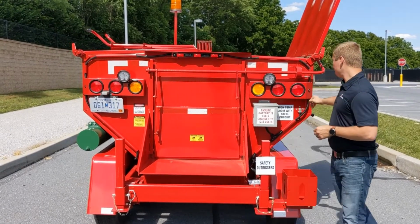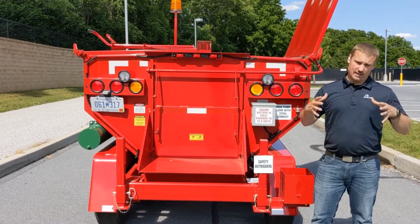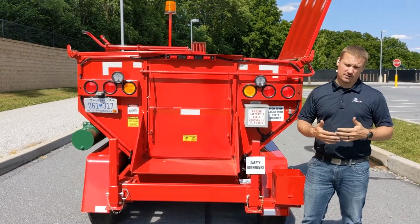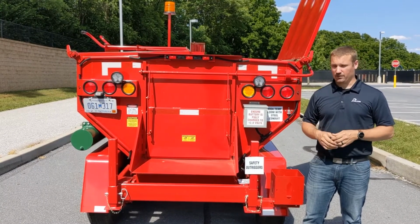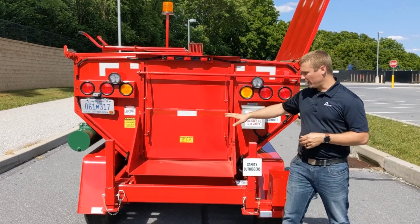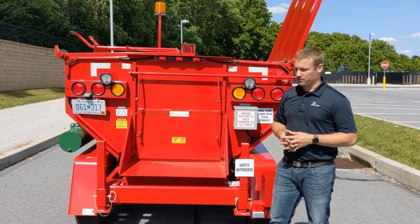The rest of the machine is triple-wall insulated and ceramic insulated for that matter. This is going to keep the heat inside the box very efficiently. The triple wall design means that you can have 300-degree material inside the box and lean on the outside of the box without burning yourself. It will rarely get higher than actual ambient temperature. So that's a very safe thing, but I like to point out that the rear door and the platform, as well as the chimney, are actual hot points on this machine.